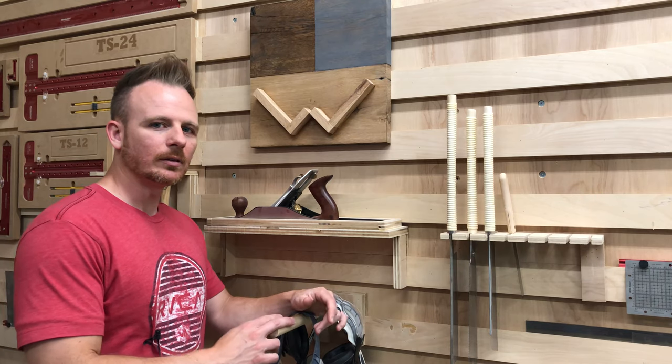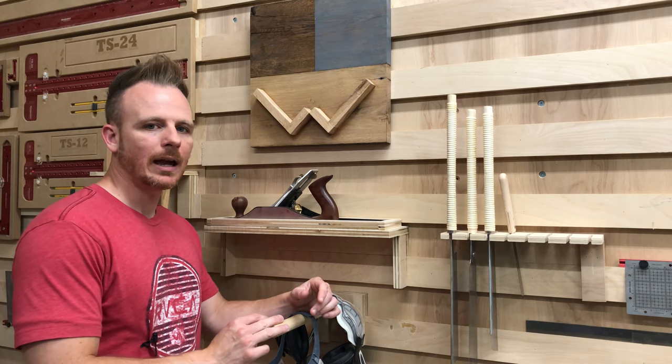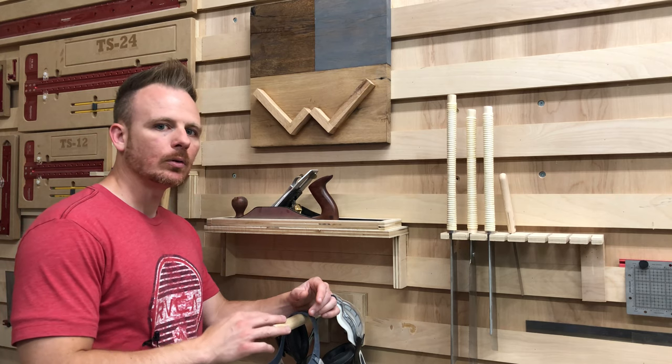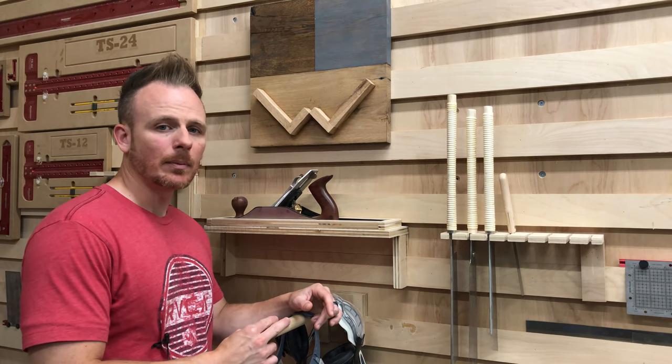I really hope you enjoyed the Modern Farmhouse Table Part 2. I actually had a lot of fun with those techniques. It's somewhat of a unique way to attach legs. Typically the corner legs are done kind of diagonal, but I opted to have two joining points on both sides of the corner. And that's something I came up with on my own.